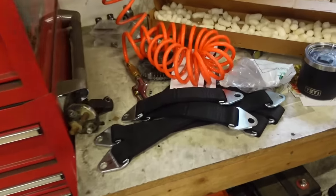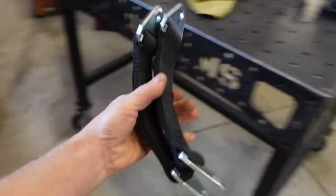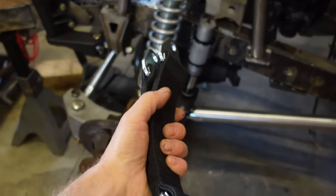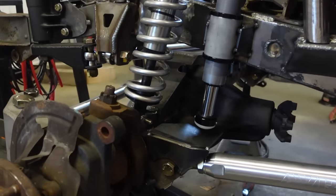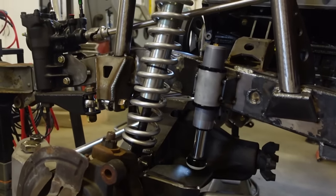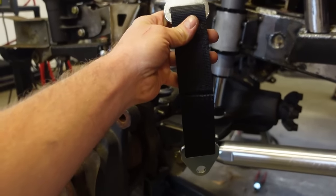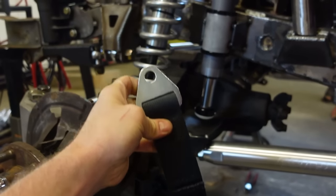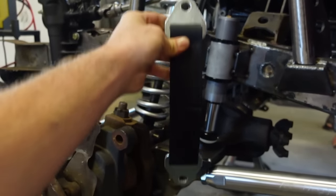So I got these ones here. I already measured them. Like I said, these stretch an inch, so you want them an inch shorter than what you measure at full droop with your tabs and everything. So what we're gonna do is get one side drooped down. We're gonna measure for our tabs. We're gonna jack the axle up 1 inch to allow for that stretch,